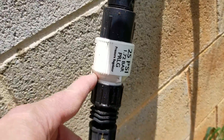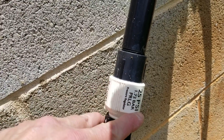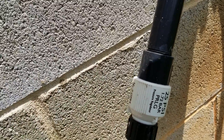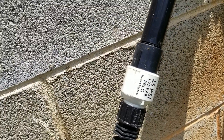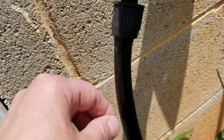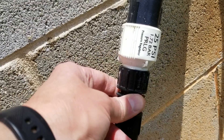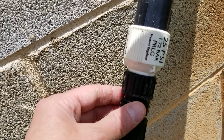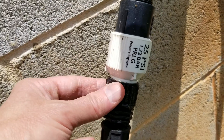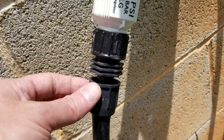This is a pressure reducer — it gets the pressure down to 25 PSI, keeps constant pressure on your system, and you really need that. Then there's a connector to the half-inch mainline, and these are basically compression fittings. This part screws on and there's a compression fitting that connects the actual line to this connector.